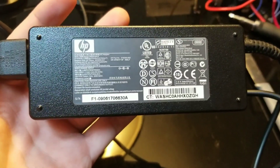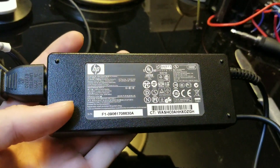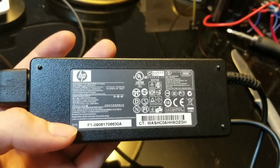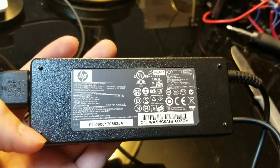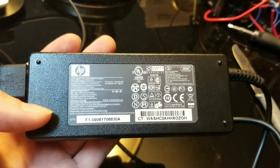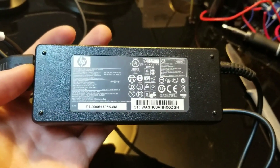The power supply I'm using for our circuit is a 19 volt 4.7 amp HP laptop power supply — I salvaged this from an old PC and it works great, giving me great arcs. If you don't have anything like this, you can use anything in the range of 12 to 32 volts, with 32 volts basically maxing out our circuit. If you're using a high voltage, make sure your amperage is also pretty high so you can get a balance. I've left a link in the description where you can buy one, otherwise you could make one — there are plenty of tutorials that show you how.